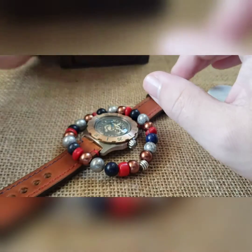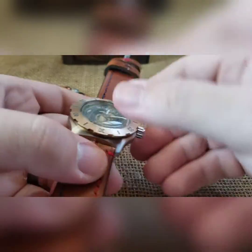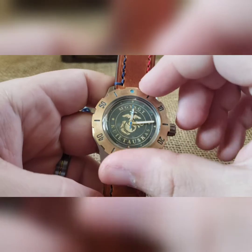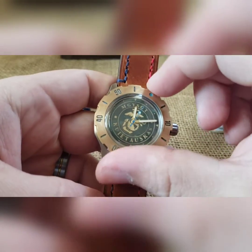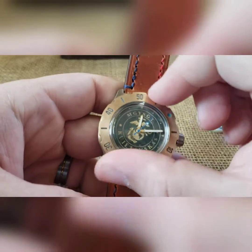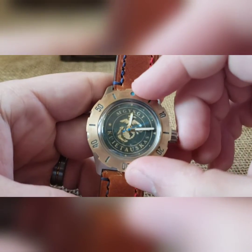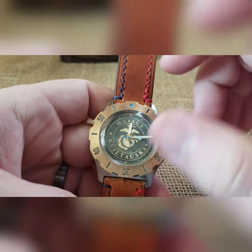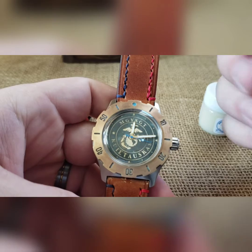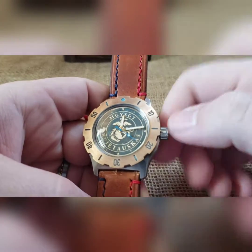I have this in one of my special edition boxes. The watch is an automatic mechanical. The bezel is held on with a tension ring — I put some dental floss around there before I snapped it on so it has resistance and doesn't free spin, but it's not on extremely tight. It can go left or right — it's only held on with the tension ring.